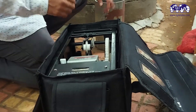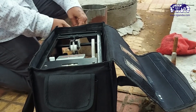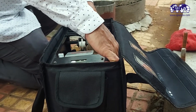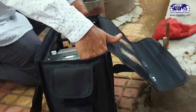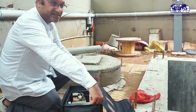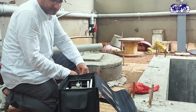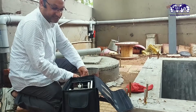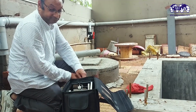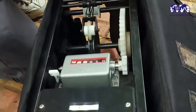As I have set it to zero, I am pulling the cable and lowering it down until I touch the water level. Before I go down, I am making sure that the switch is on — upward direction is ON, pressing down is OFF. Now I have confirmed the switch is on and I am tracking the cable further down. As soon as it touches the water level, you get a buzzing sound and the LED light glows. It has now touched the groundwater level.